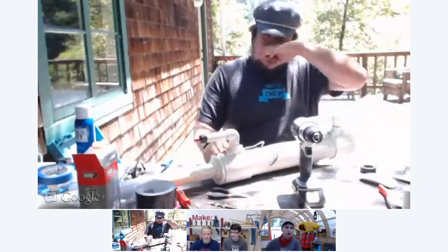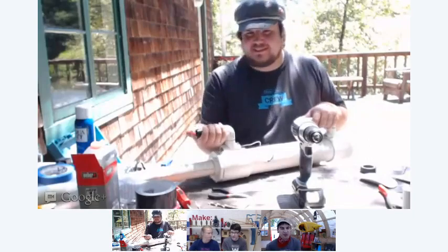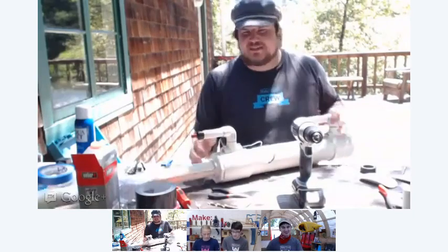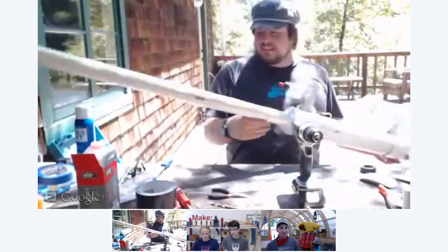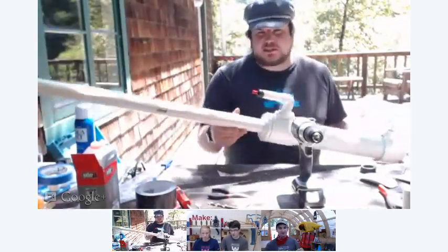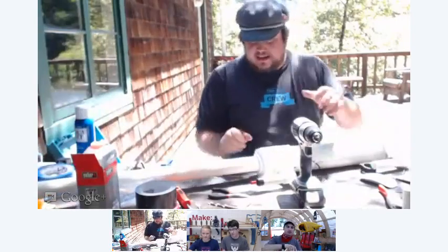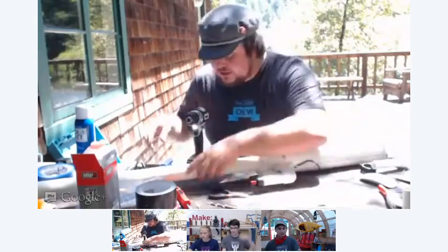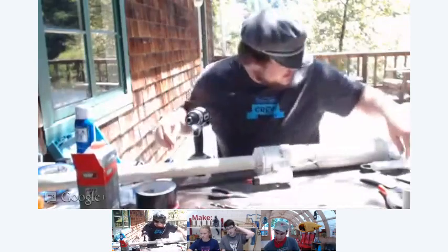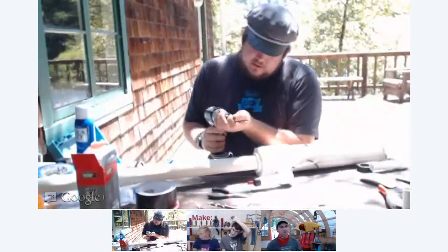So we're shooting ping pong balls today, so that's a pretty safe experiment. But maybe try ping pong balls before you go up to the potatoes. Yeah, you should definitely stick with ping pong balls for now. All right, so we've got a barrel on. One of the issues is sometimes the projectile, especially with the ping pong balls, will fall through into the combustion chamber. So what I like to do is put a bolt through the breech of the barrel to keep things from falling out. So you're going to use your 3/16-inch drill bit and drill a hole all the way through the barrel, both ends of the barrel.